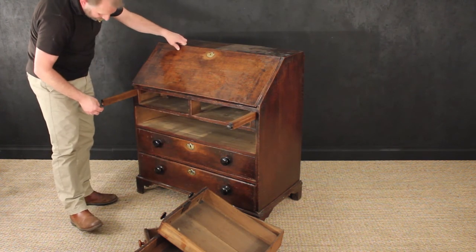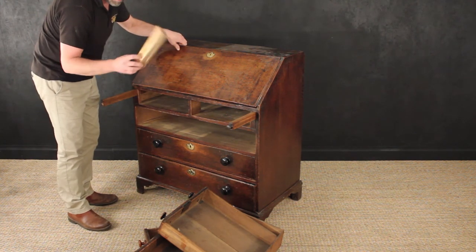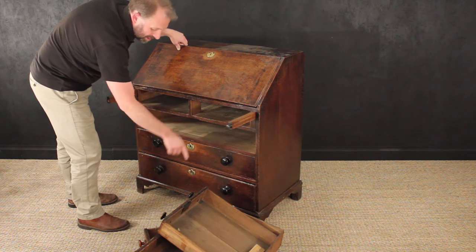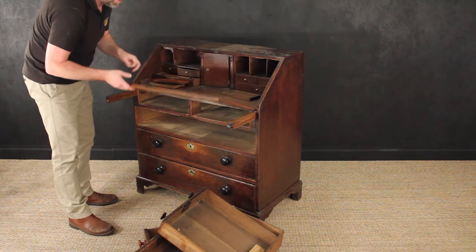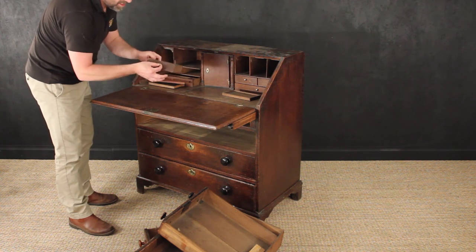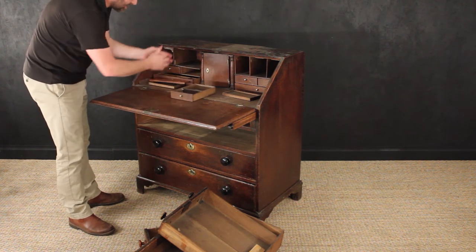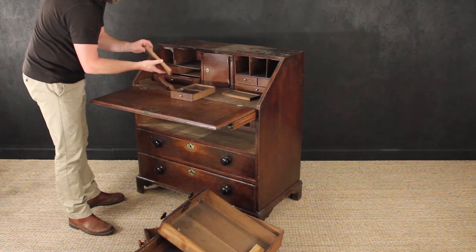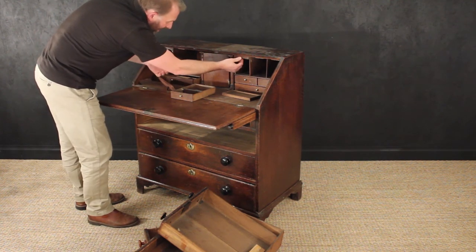The lopers have also been adapted, and there's a draw guide that needs attention. They had wooden knobs at the same time as the Victorian ones, but they've all broken out. What remains of the wooden knobs will be taken off and replaced with either possibly gilt brass knobs like this, or lac drops, or something appropriate for this period. The interior is a mess — the pelmets are missing, though some remain. These are actually secret drawers — they sit up there looking like pelmets but come out as secret drawers.